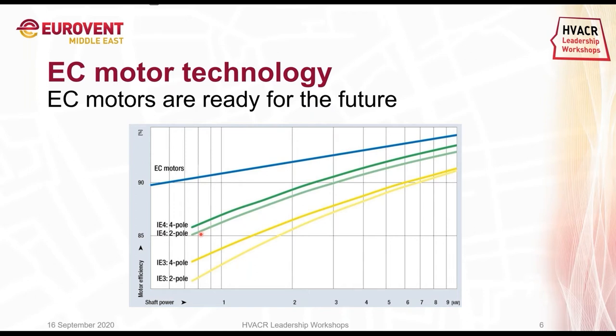Of course, we also know that IE5 is coming, which is not completely fixed yet, but we think, and we already heard and see, that the IE5 line will be somewhere between the EC motor line and the IE4 motor line. So basically we are ready for the future and still more efficient than the IE5 motor ratings, as it seems right now.